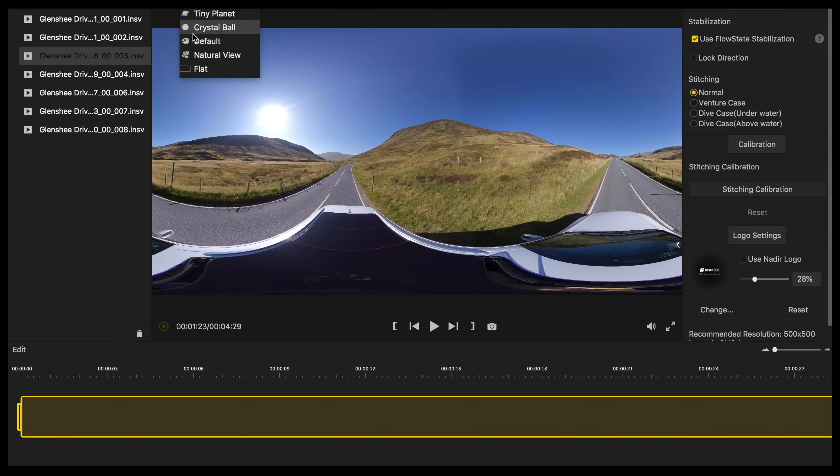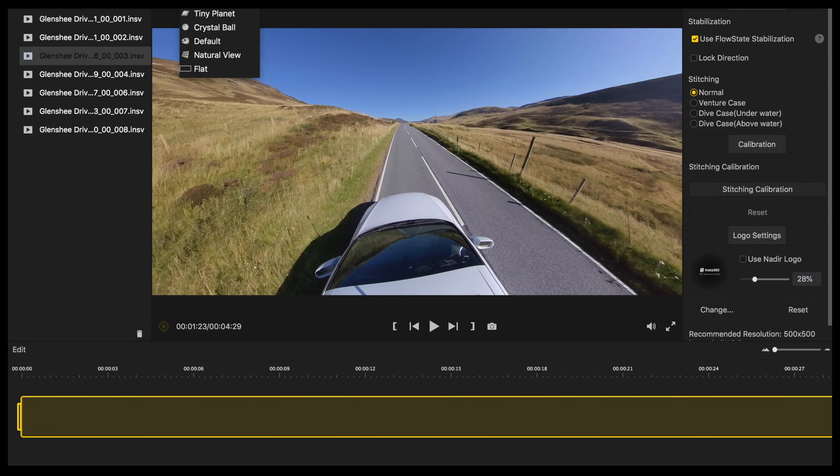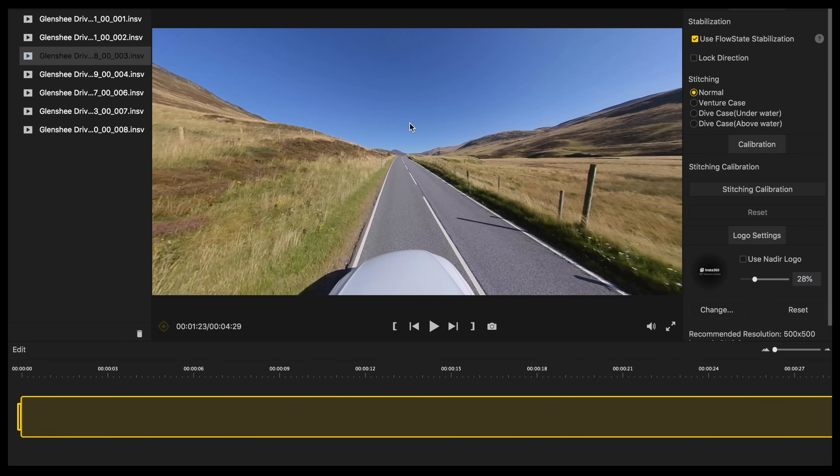Going into the Insta360 Studio is fine for 360 camera work — picking your lens, reframing, and so on — that's fun. But when it comes to the action camera side, if the only reason you're going in there is to implement electronic image stabilization, that's certainly not a benefit. If GoPro were to migrate their HyperSmooth system to a one-inch sensor platform, it would require a ton of extra processing power. The new GP2 chip in the GoPro 10 has given us some extra frame rates and a more responsive touchscreen, but I'm not sure that's the step change required to deliver in-camera EIS with a one-inch sensor.